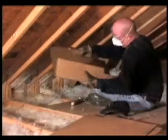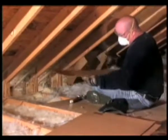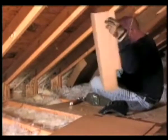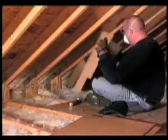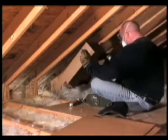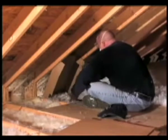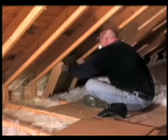After attic rulers are in place, install the proper ventilation. Homes need to have an even, balanced system with equal amounts of intake ventilation compared to exhaust ventilation. Make sure to check with building officials for codes and/or acceptable practices for your area.